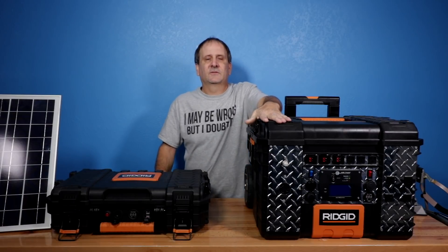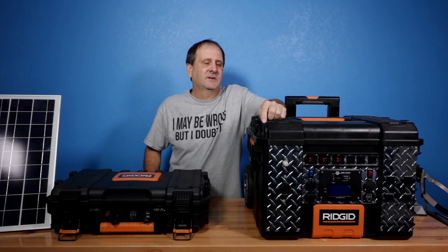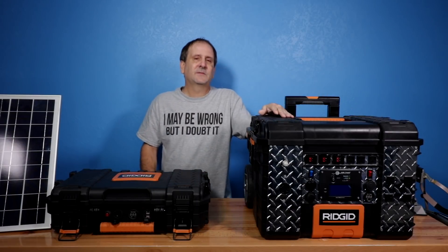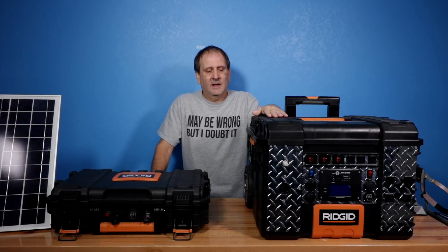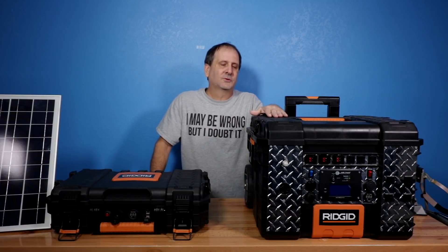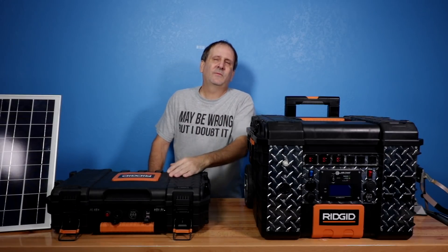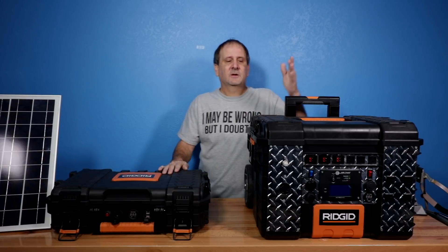This is the low frequency inverter — this is the one that runs all the real serious hardcore electronics. We've got video coming out running air conditioners; in fact that'll be my next video, just running a couple of air conditioners and a lot of things at one time. This one has the big 100 amp hour LiFePO4 Headway 38120S cells in it. We're going to call these a 9000 watt and a 1200 watt — they've got some other names and spins we're putting on them for advertising and marketing purposes.